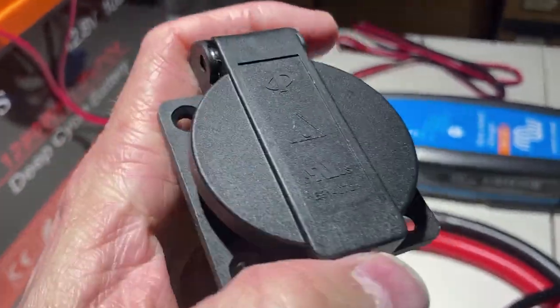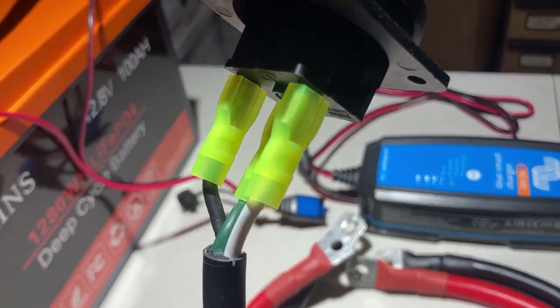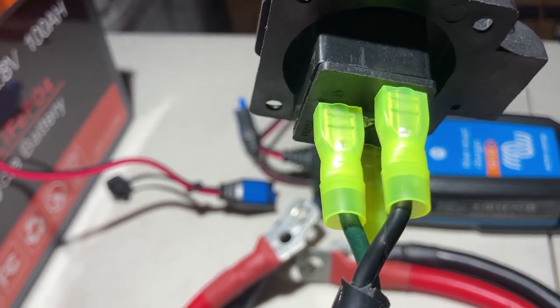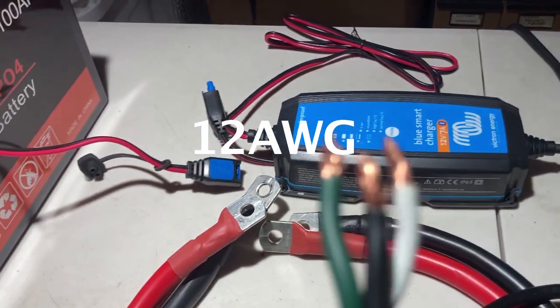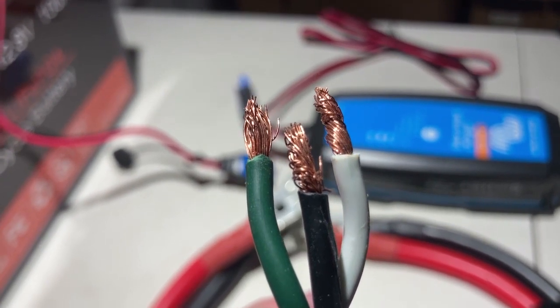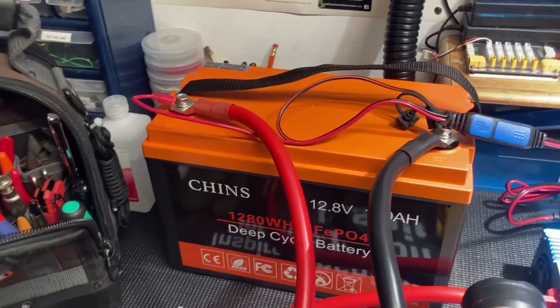Also, check out the description below for most of the components I'm using in this video. Following the links will help you out and can help the channel a lot. This will be one of the AC outlets for the newly installed Apex. Here I'm using 12-gauge copper cable with the proper size connectors crimped on securely. It is critical to use properly sized quality cable throughout the build. I was able to save some money here having a few spools of various sizes around the shop.